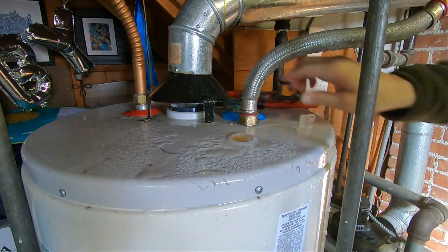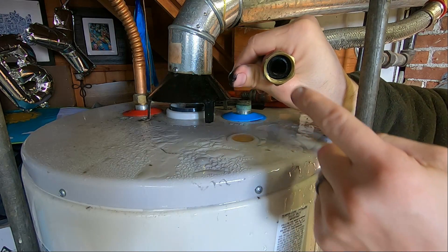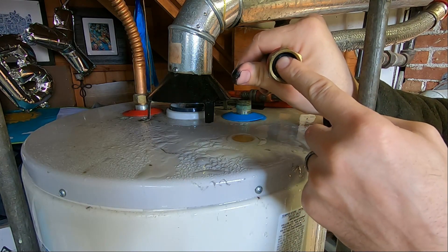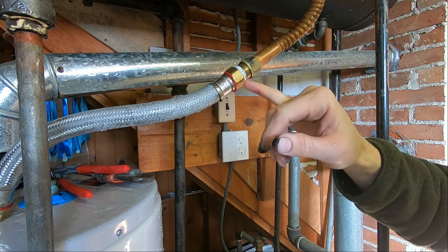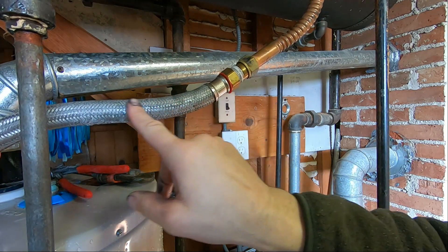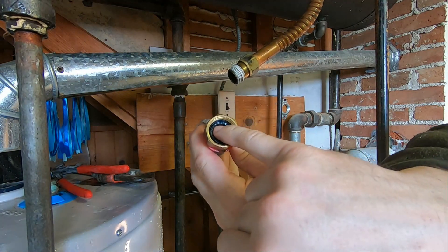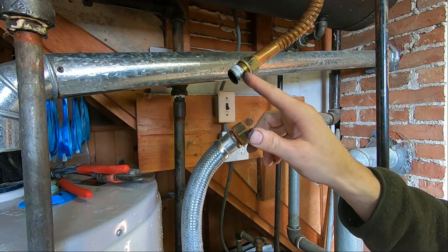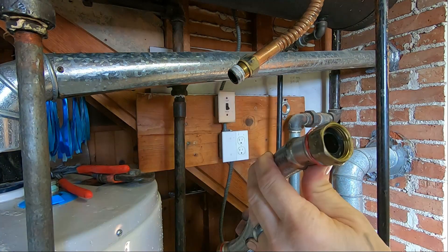Sometimes the rubber hose gets pushed in there, or the rubber washer. This is the rubber washer — it looks in decent shape. This is what creates the seal. When there's not a hole in the pipe, it's just like a garden hose — that's what creates your water seal. They've got Teflon tape here. Some people say it's to lubricate the threads so they don't corrode, but I've never really seen brass fittings corrode. This rubber O-ring is what makes the seal, not the Teflon tape. I get that in every plumbing video — people ask why I didn't put Teflon tape on a compression fitting. This is a type of compression fitting because you need to compress that rubber O-ring to seal it up.